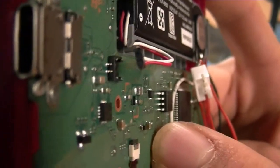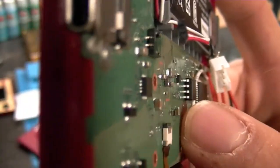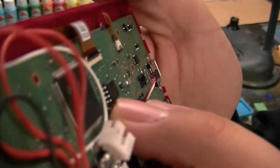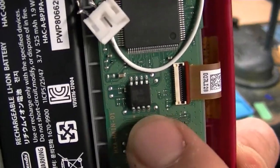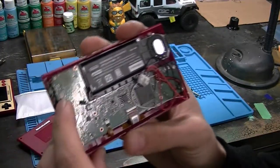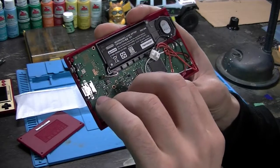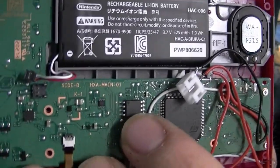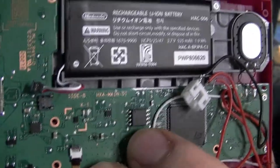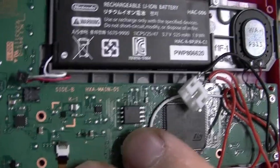We're going to be cutting all four of those pins off where the solder meets the board, just to get this chip out of the way — cut those four pieces off, turn it around, and cut the other four pieces off to get this flash chip off. That's the way I'm going to do it. If you don't do it that way, you can use a hot air machine — you blow hot air onto the solder points and that will desolder this chip. You could probably desolder it with a soldering iron too — I tried to do that but it was unsuccessful. You can definitely try different ways and I'll link them in the description.